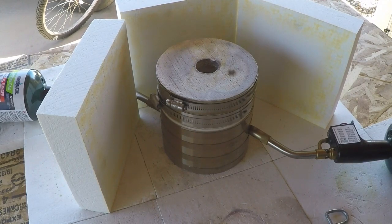What they do is they call it opening. The top of the burning pool of lead opens up, and if there's any slag or any contaminants, they roll to the edge of that burning pool of lead. Then the atmospheric oxygen, as it contacts the burning pool of lead, converts it to litharge and the cupel starts to absorb it. It's kind of in a humpy position. Once that process starts, it generates a lot of its own heat by an exothermic reaction.